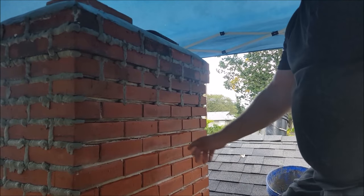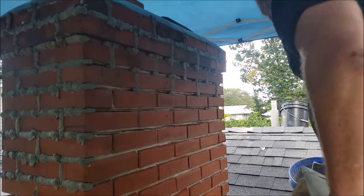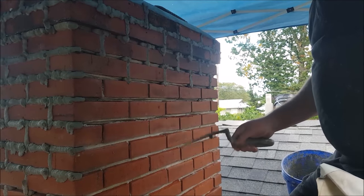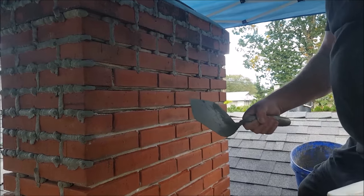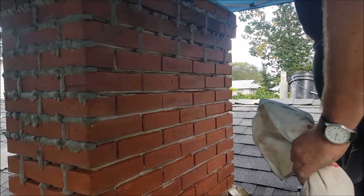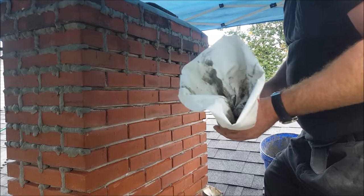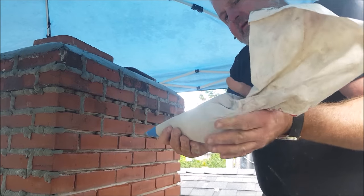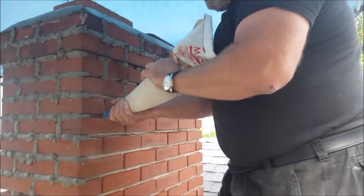We've ground out all of our mortar joints and we're going to start squirting in the mortar mix. We've got a Type S mortar with a bonding agent mixed in it. Here's a bucket trowel — a seven dollar trowel from Lowe's with the top two inches cut off so you've got a square bottom to scrape the bottom of your bucket. That's a good tip. Grout bag. Getting the mud out of the bag is a combination of keeping it cinched up — you've got this triangle here, keeping a tight triangle, cinching here and squeezing. It's a bit of an art, takes a little practice.